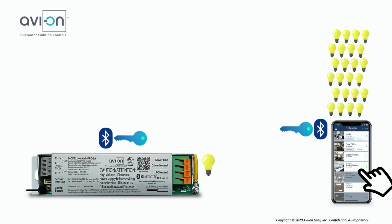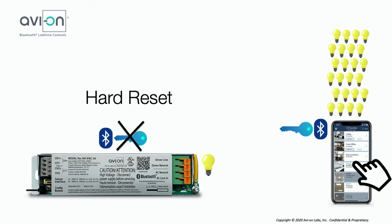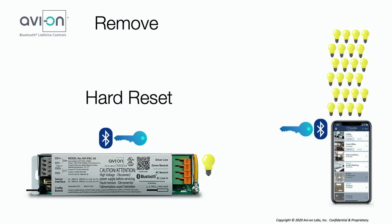Something you need to be aware of before doing a hard reset. Each device has a secure key it receives when it joins a network. When you do a hard reset, it sets the device back to factory defaults and removes the secure key. During this process, the app and cloud are not aware that this has happened, with an end result of an orphan device in the app that cannot be controlled. You will want to remove the device from that account first and then do the reset.